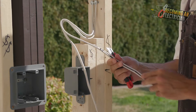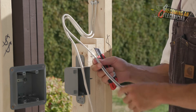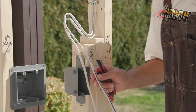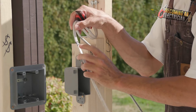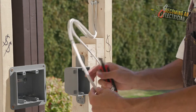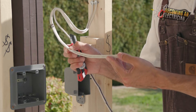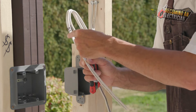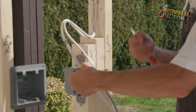We already have our label - you can see the line indicating it's power. You want to make sure you're labeling up higher so that when we strip here, we're not removing the work we just did. You can also see the switch leg label right here, so we know that goes up to the light. If you strip the jacket, the label still stays there. Many people label down here, which is a waste of time because you'll cut it off. You should be relabeling so you know what it is later.